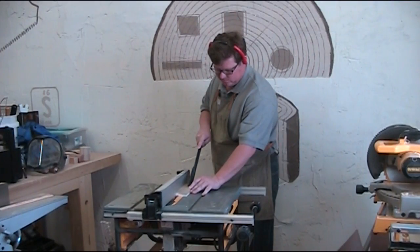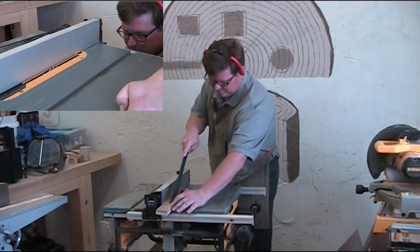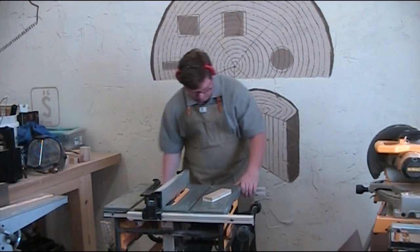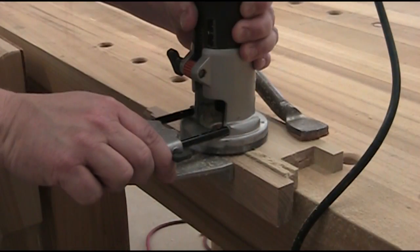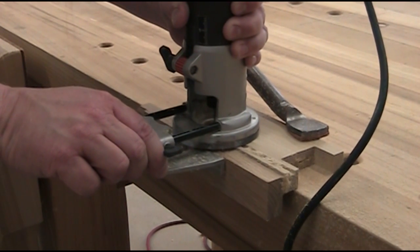There is no end-all be-all best way of making grooves. A lot of people prefer using power tools, especially a table saw, where all you have to do is set up the height and adjust the fence. You can even put in a dado stack or make multiple passes with a standard blade. Some people prefer using routers.